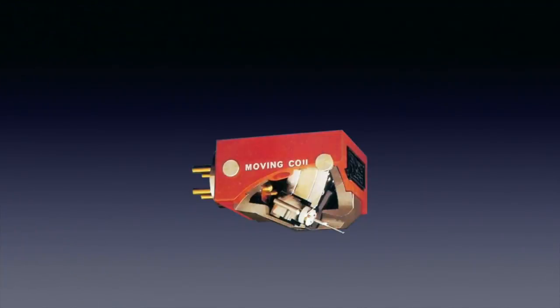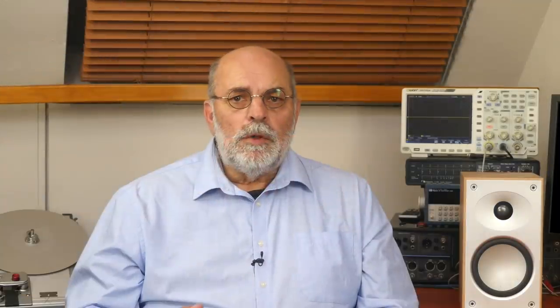The construction of a moving coil in a permanent magnet is not only used for loudspeakers. You must have heard of the moving coil cartridge for turntables — it generates minute voltages as a result of a coil mounted at the end of a cantilever moved by the stylus. But also the bicycle dynamo uses this principle, as do modern windmills. So a loudspeaker must also be able to generate voltages. And it does. On the desk you see a loudspeaker I use in my setup. The woofer is connected to the oscilloscope and when I move the cone by tapping on it you will see a voltage on the scope.